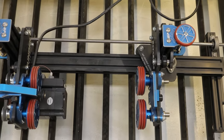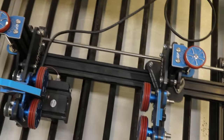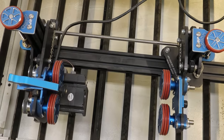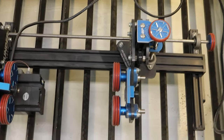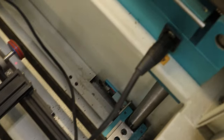The next step is to make sure your rotary is straight on your machine. I line my laser dot up with a couple of spots on the rotary to keep it straight, and I also line it up on the knife bed. It has magnets on the bottom to keep it still. Once that's done, make sure your rotary is plugged in.